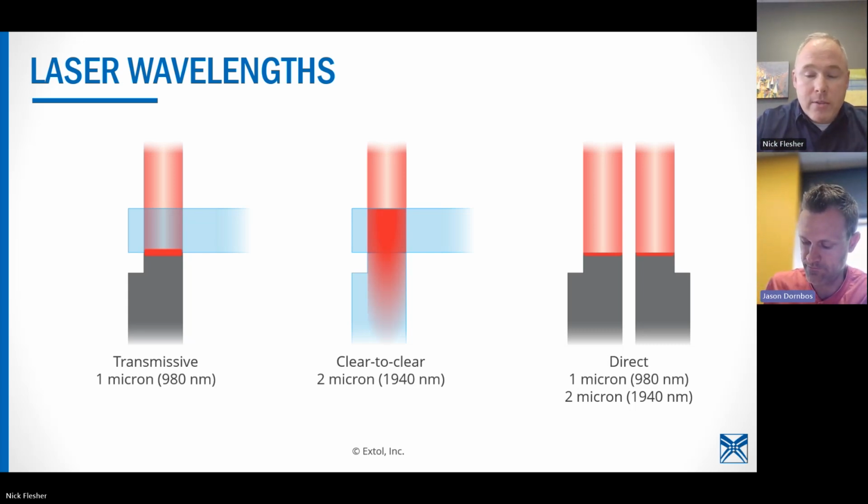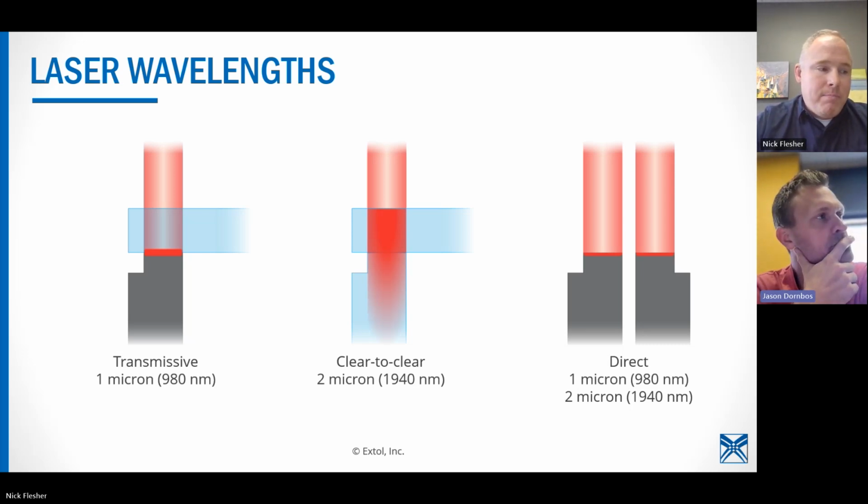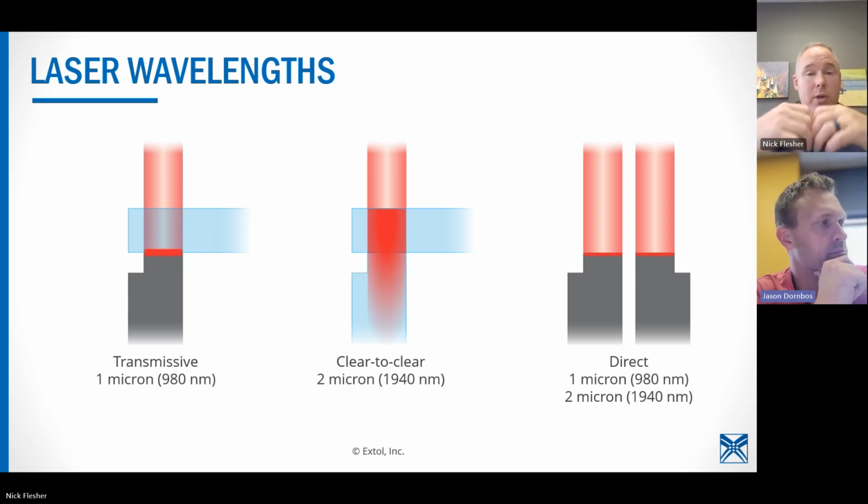What's the weld strength level? Excellent question, Oscar. We always say it depends. We typically want to see 80 to 90%. Most of the time, parts are breaking in different areas, which we call parent material if we're doing a burst test. If you're doing a tensile test, our target's 90%. 100% is not typically that likely. When you do hot plate welding, you can hit 100%, but that's because your flash gives you more strength. There's not much flash here.